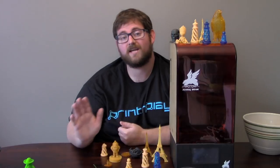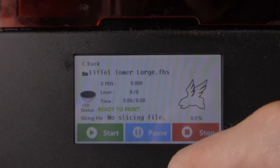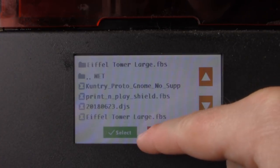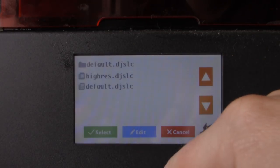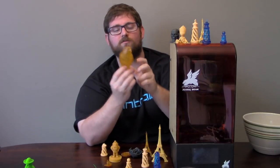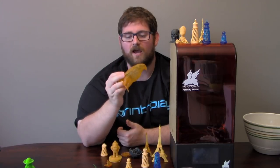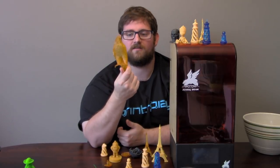You can put pre-sliced files directly onto the USB stick and they become accessible through the menu. Setting up this printer was literally as simple as leveling the bed, filling the vat, and selecting the file to print. Printing is a little different than FDM — you have to provide the sliced file as well as the slicer configuration so it knows how to deal with that file. This was the first print I completed — one of the sample files included in the 6 gigs of internal memory. If you go with the Wi-Fi option, you can FTP your entire library directly onto the unit. The print completed first shot, the support material came away fairly clean, and it's a good example of what it can do.